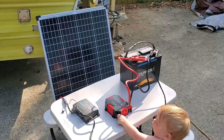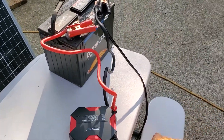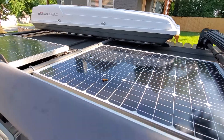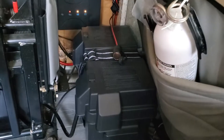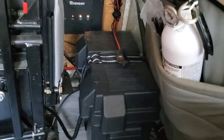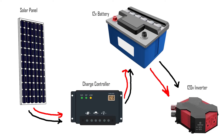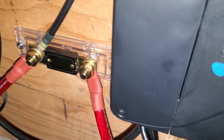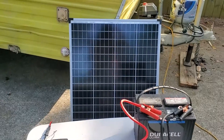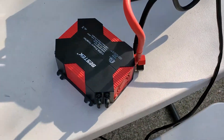And that's your whole system ready for off-grid power harvested from the sun. On my van, I have solar panels which run to the charge controller — that Renogy unit — to a battery in a box, and then out from the battery to an inverter. It's the exact same diagram, just larger and heavier-duty components. You'll definitely want the proper size fuse between the inverter and the battery. To recap: solar to charge controller, charge controller to battery, and battery to inverter. Hope that helps.